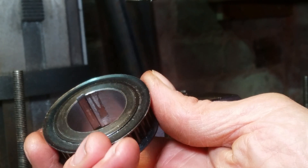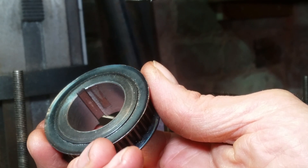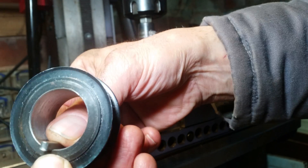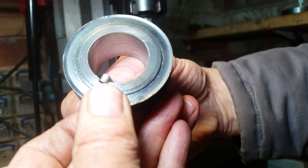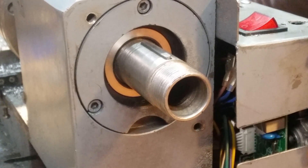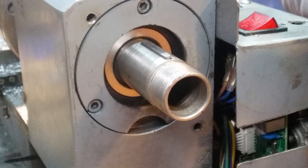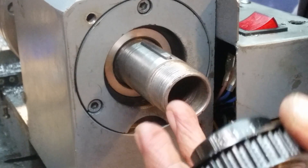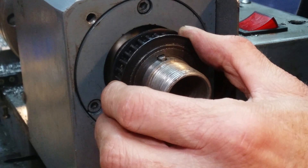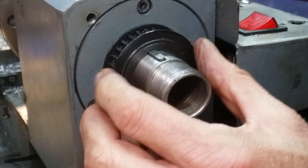That's what it looks like. You can see next to it there's a false start right at the beginning — I kind of made a pig's ear of that. But now you can see it's reasonably square. When I put the key in there it's not seating very well, it's just slightly too narrow, so I'm going to have a little go with the file. With very very little work with a file — really just a few strokes on the edges to bevel the hard edges down a bit — that goes on really nicely with very little play at all. I'm really happy with that. It's even a better fit than the original pulley.